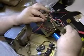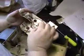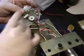This black wire right here — we're going to unsolder that; that's actually the ground. There we go. So now we've taken the old regulator apart. This lead in here is the minus 36 and this lead here is the plus 36. These leads will have to be fixed in this particular instance because they're frayed. This is the ground and these are the two speaker leads — those are the only things you'll have left on this board.